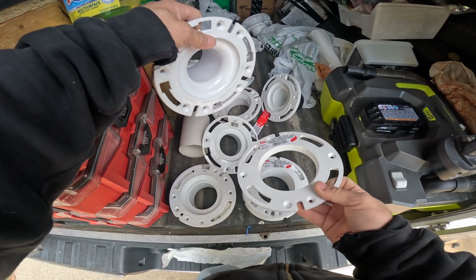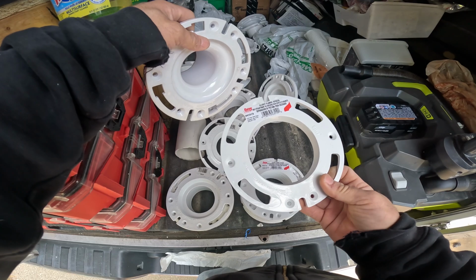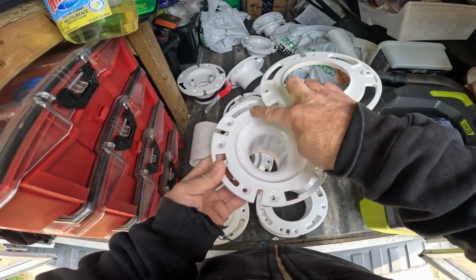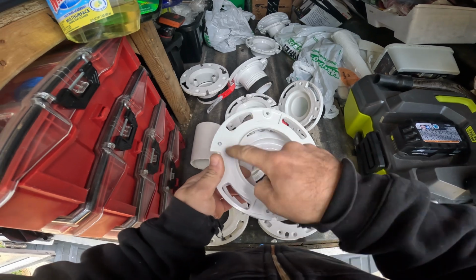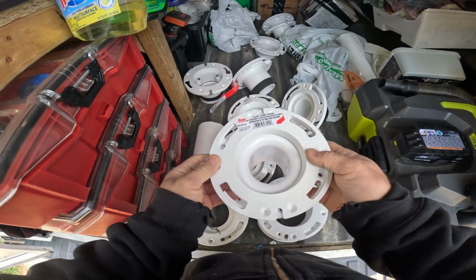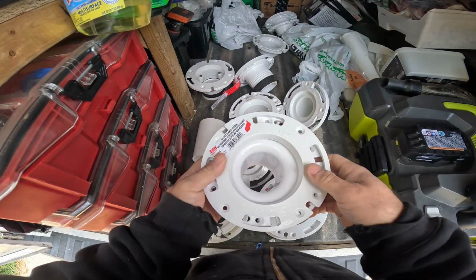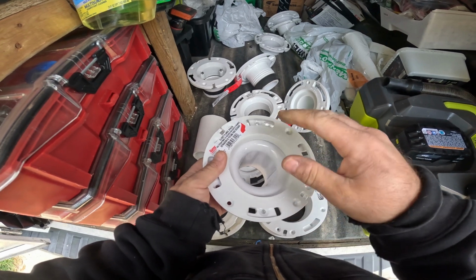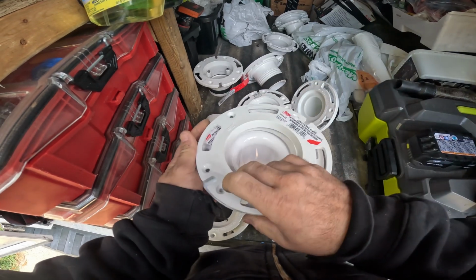When you use spacers, the spacers usually fail. If not done properly, they'll leak. So what I like to do is put a bunch of silicone all over this thing before I do it. I put a bead of silicone all over. I get pretty excessive. Then you would fasten it down. And if you have to keep stacking them, you would just keep doing the same thing over and over again. Take the sticker off, silicone it. Same thing, add some more silicone here. Stack it.